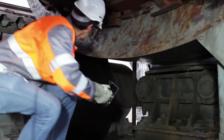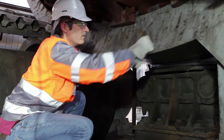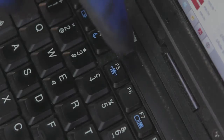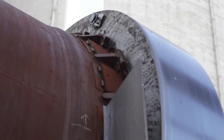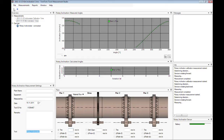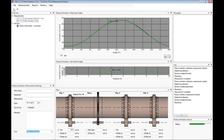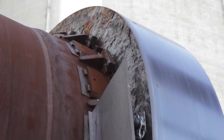The heat shield will protect the tool from the heat coming from the kiln. Then attach the inclinometer carefully to the side face of the kiln tire. Make sure that there are no obstacles in the way of the inclinometer. Click on the Start button or press F5 to start the first measurement. Please note that the surface does not have to be straight nor machined, but magnetizable and clean enough that the magnets apply sufficient force so the tool does not fall off or shift during the measurement. After a few revolutions, the inclination values become stable and the measurements can be stopped by clicking the Stop button or by pushing F6.